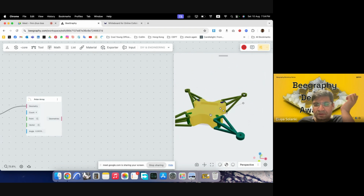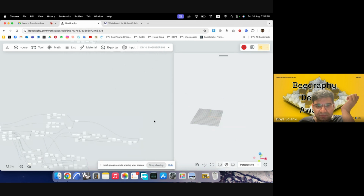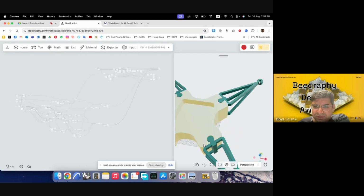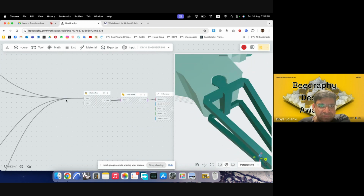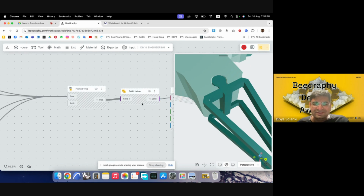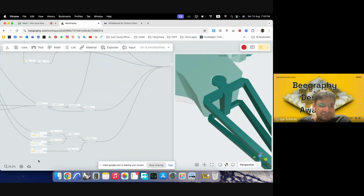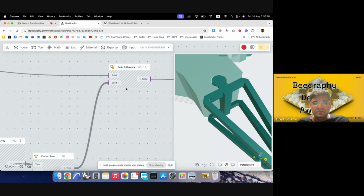So for printing them, I'll just disable this whole script. It's basically the same thing, and I'll just preview on my previous script. I wonder whether it works here. Oh, it should. It is working. It has subtracted the outer shape, and it is boolean in here. I did flatten it. Solid. Oh, does it go in the same, or was I using some other solid union? Might be the case. So it's solid difference that has an issue. There's a solid difference also here. Yeah, there's a solid difference. Might be an issue with this particular component. Some simple bug can be probably modified.